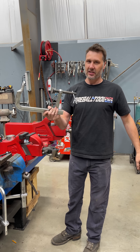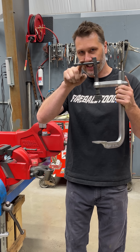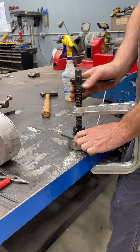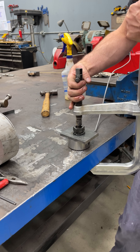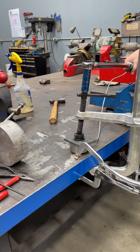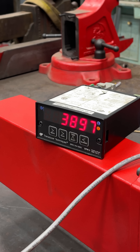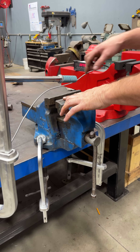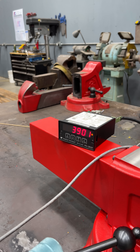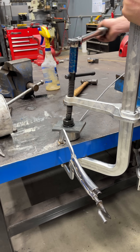I want to demonstrate with just this simple C-clamp. I know that this C-clamp can output more than this vise with this little tiny handle. We're just going to clamp this probe right to the side of this table. Cranking it up — 500... 800... 2,000... 3,000. I think that's the max. But look at that — we didn't quite get to 100 foot pounds of torque but we're almost at 4,000 pounds of pressure. That's why I feel like this vise is just weak. It gives you the impression that you have a lot of clamping force, when in reality 4,000 pounds — that's a lot, but it's really not that much. A C-clamp can produce that kind of force pretty easily.